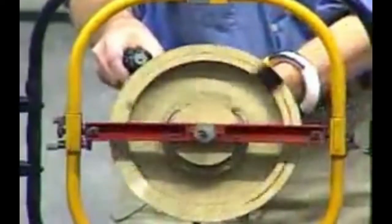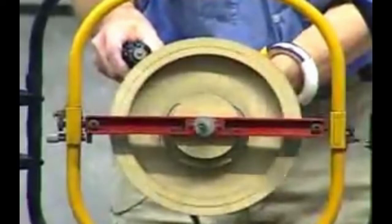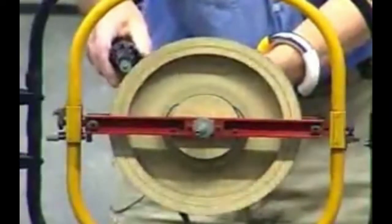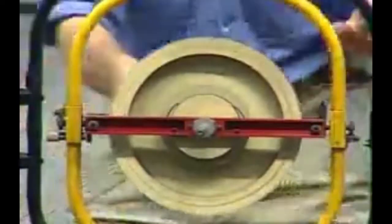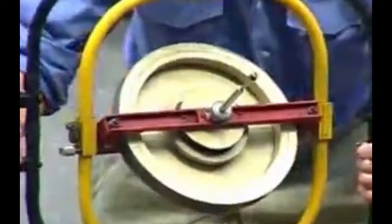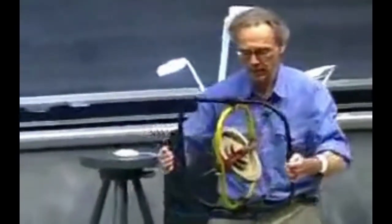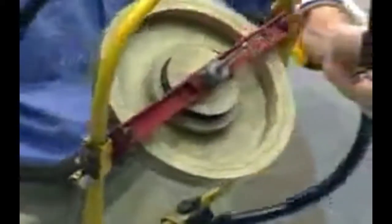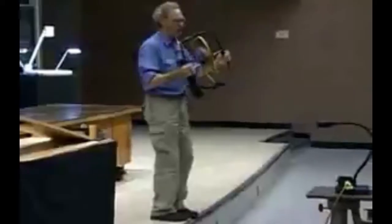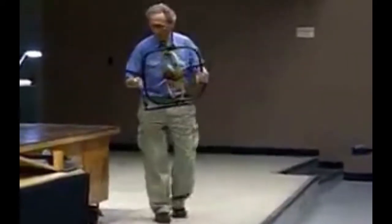And I want to show that to you. This is the direction of my spin angular momentum, and I'm the airplane, and I'm going to fly. Look at that spin angular momentum — it has no respect for me. It stays in the same direction no matter how I fly. And the error signals that come from the bearings of the yellow housing and the black housing, those signals are fed back to the automatic pilot, and so the plane will stay on course.